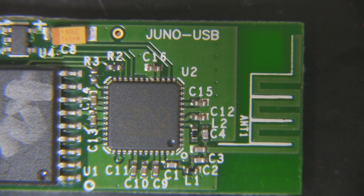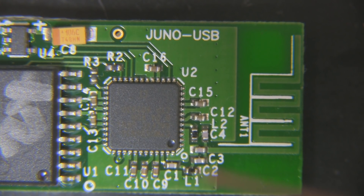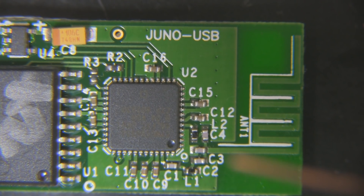With this particular chip there are two pins - one for TX and one for RX - so you have two tracks coming out of the chip to the antenna. On pin 3 on one side there's a trace and a couple of capacitors leading into the antenna - that's the RF in signal path. On pin 5 on the other side, you can see a track coming out through a couple of capacitors leading up to the antenna - that's the RF out pin. So you've got two pins combining into one antenna.